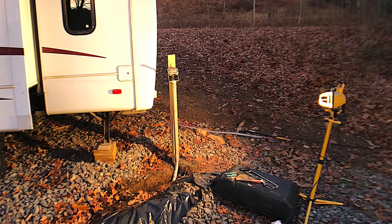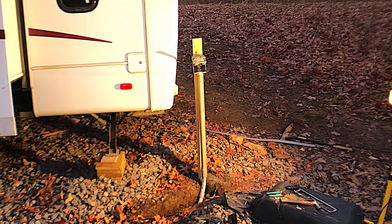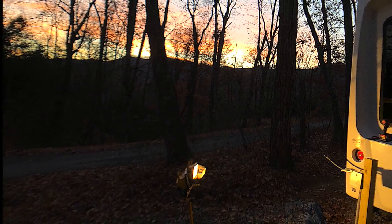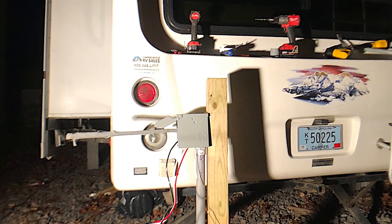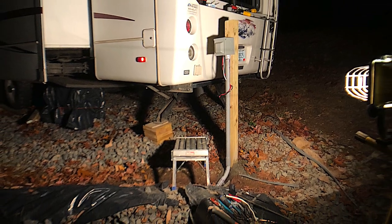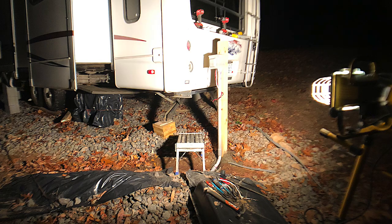So, of course, I redid it to correct my mistake. I wound up pulling the wire out of the box and then removing that lock nut from the nipple that goes into the box, put the locking nut over the wire, and secured it on the inside of the box where it should have been in the first place. I didn't videotape anything because it was too cold and it got dark fast, and I wanted to get it done, but I did go a couple hours, I guess, stripping wire and fighting with the wire to get it inside that box and connected to that receptacle. So I was glad I got it done and finally went inside and got warm.